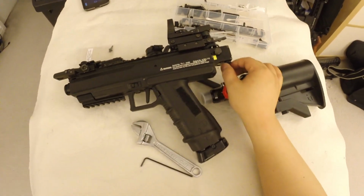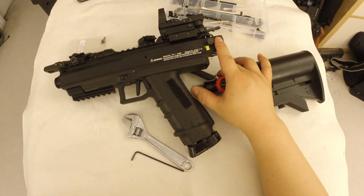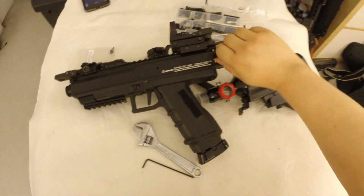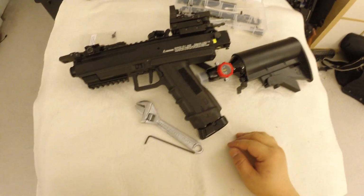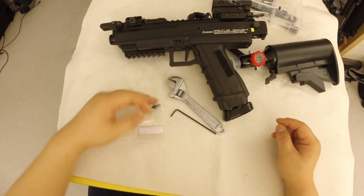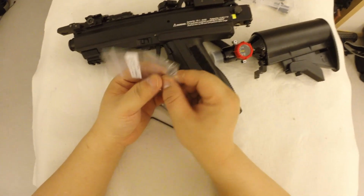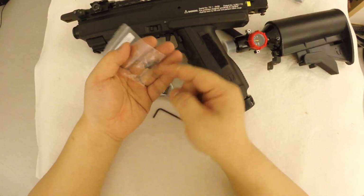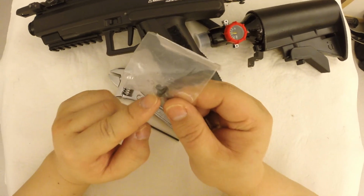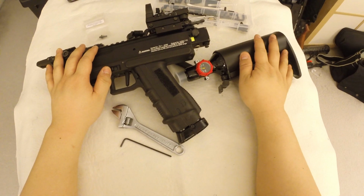But a lot of people who buy the CQB version and such without the stuff set up for rear stock air, the problem is you put the thing here, turn it on, and then air will leak from the mag. What to do? So this is what we have to change out today, the solid CO2 stem. This is the stem that the gun comes with. Look inside the long end right here. It's solid, and that's the stem you need. Remember, there's an O-ring here too. Don't forget that. So you need to change that out right here in order to use the tank.